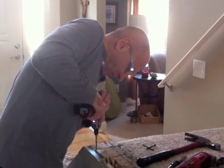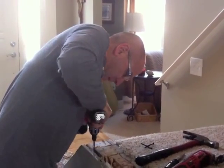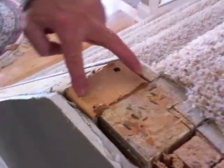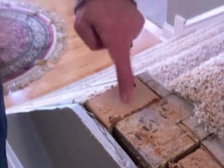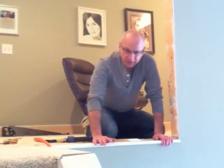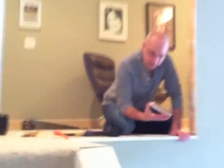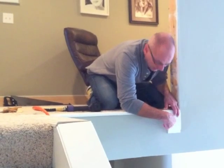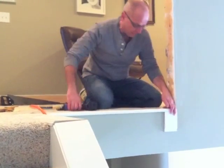As you can see, I'm filling this spot that we talked about. I cut the board, glued it, and put a couple of screws on the outside — we'll be solid when we put the Newel post in there. I've got some boards cut and I'm going to start nailing in here. I plan to face the front of this with molding, so I'm going to hold the board out that far in.